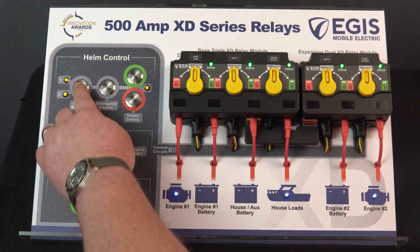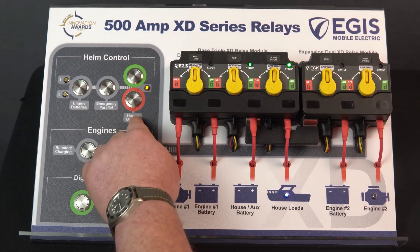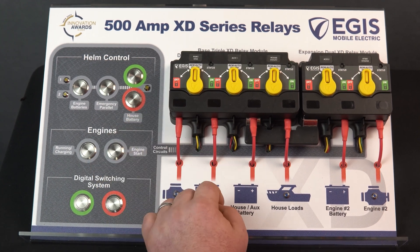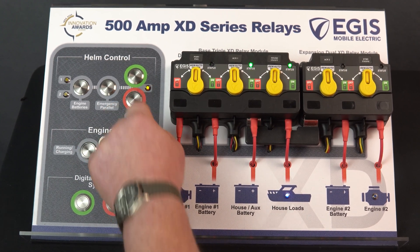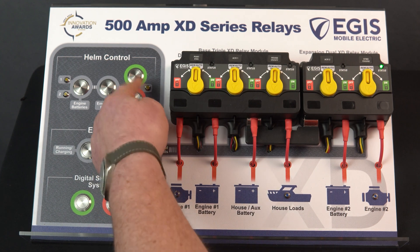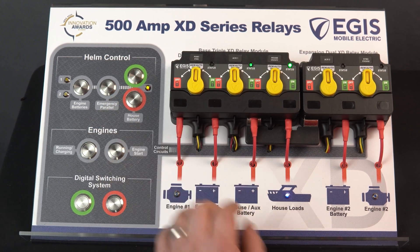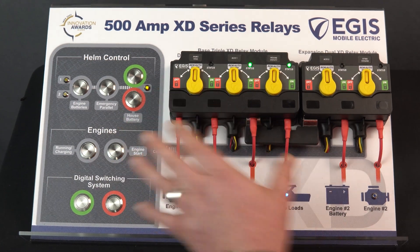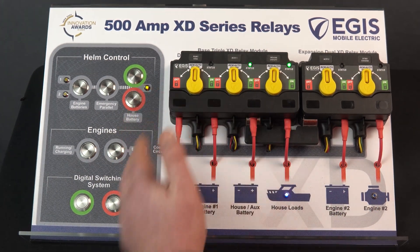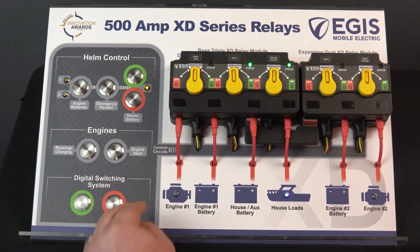If I wanted to shut off the engine batteries, simply deselecting the permanent on/off switch will turn off the engines, and for the house battery I would press the red button here. You can turn it off and on via the momentary switch, and there is a three-second safety delay to prevent unnecessary switching. There is also a two-second momentary off signal that can be used to control these relays. There's also parallel control — using the two-wire configuration we can have parallel switches at different control stations to control the exact same battery bank and relays via a different set of switches.